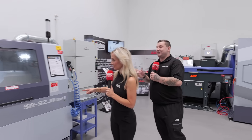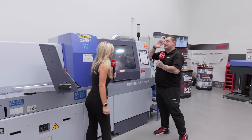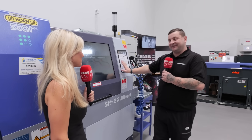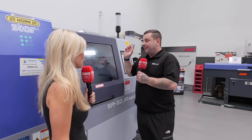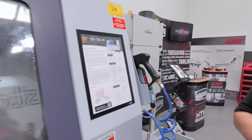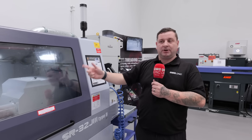The SR32 J3 Type B — you will have seen this machine everywhere. This is one of the most popular machines they sell. They're showcasing two things on this: full wash-down from inside, and also a wash-down gun. I've never seen a wash-down gun on a sliding head before, or full internal wash-down of the machine. Working with sliding heads is a bit of a nightmare because it's all oil — so if you can use the machine to clean itself, that's better for your programmer and your operator.